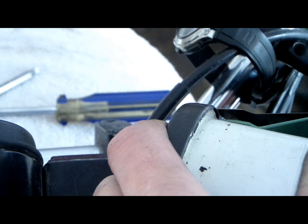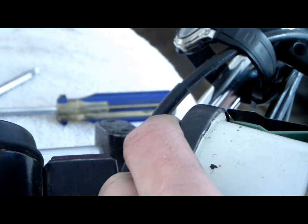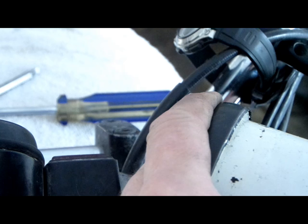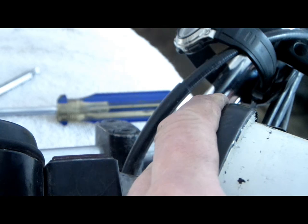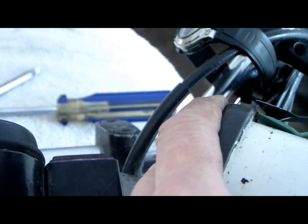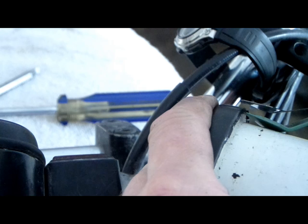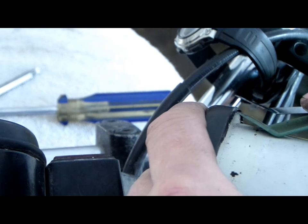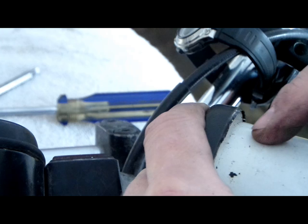Sometimes when I'm working away I don't know exactly what I'm saying, I know what I'm thinking. But as far as instructional goes - I'm bending that. I don't need the whole ring bent out, what I need is about a third to a half - probably a third is plenty. You don't take too much at a time, you work your way. Metal's a funny thing, you just take a little at a time until you get it where you want it. It's a real slow process - I don't want to break that housing either.